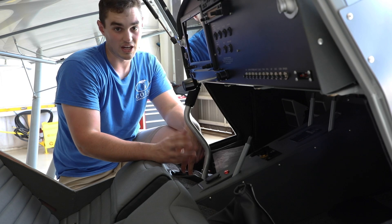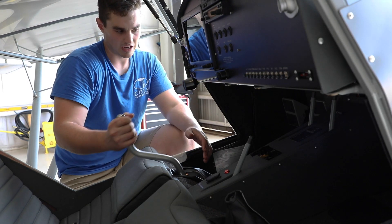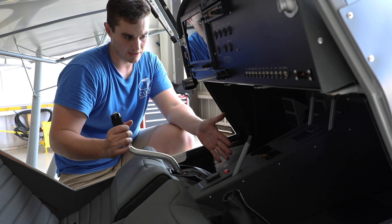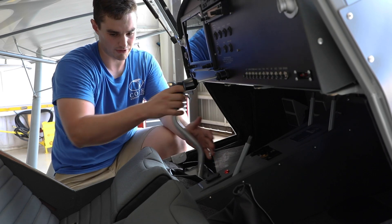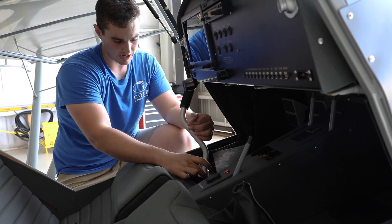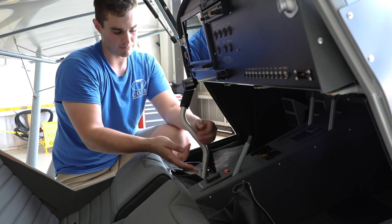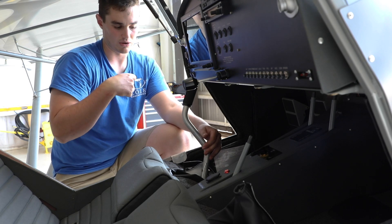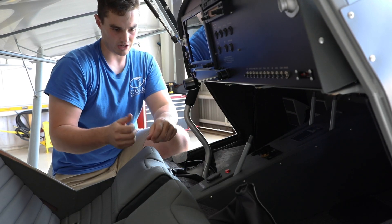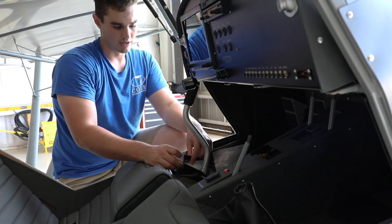My final rigging has been redone for the elevator and the ailerons. I fixed the control stick so that it's no longer rubbing the seat pan and no longer touching the dash. That constrained angle is basically four degrees short of what the factory recommends — so I did 40 degrees back and 14 forward. That's going to be just fine; I'd rather have the back correct and the forward a little shy than the other way around. I was also having issues with the push-to-talk, so I rewired from push-to-talk down, drilled another hole in the side of the stick above the mounting points, and ran that cabling up. There's a connector down there so I can pull the whole stick out modularly without unwiring it — same thing with the right side, which is one bolt and one plug.